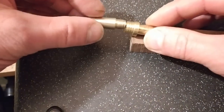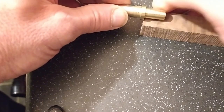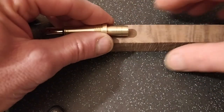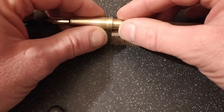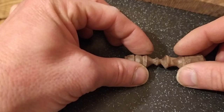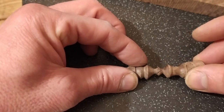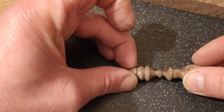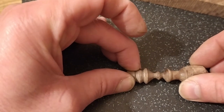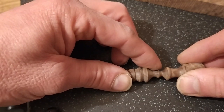Essentially the hole has to go down far enough to allow for a tight fit on that, which I will glue in with epoxy, and for this to go in — the tip and everything else can go in afterwards, so it will fit right the way through. This remains in the wooden bit and then this bit unscrews from it. In pen-making terms, I'm sure this would be considered a very, very simple pen kit. But if I can make a usable pen from this I will be very pleased — and this is going to be my first proper project on the lathe. I've just removed the remainder of this blank from the chuck jaws, and for a bit of freehand work with the gouge, I'm actually quite pleased with that. That's my first proper attempt at turning something with a gouge — with a wood turning chisel — and I think it looks quite nice.